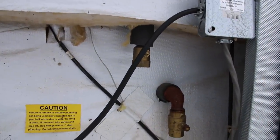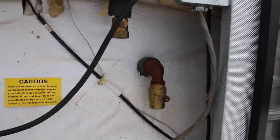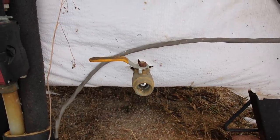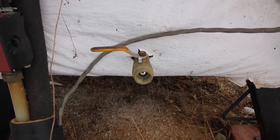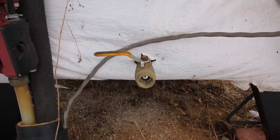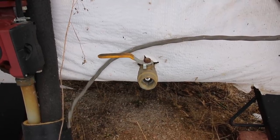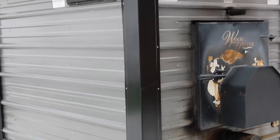This attachment here means I could add another circulating pump to provide heat to a different building if I wanted. In the summertime I can open this valve, flush out the water from the reservoir, and put fresh water back in. Some people use glycol but I just use water because I run this furnace all winter so the water never freezes — no point wasting money on glycol.